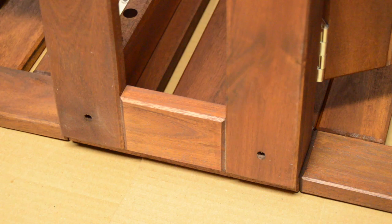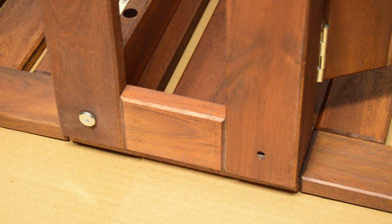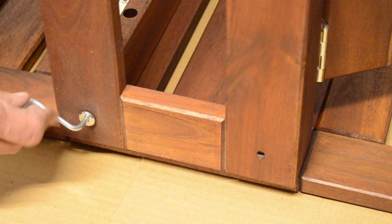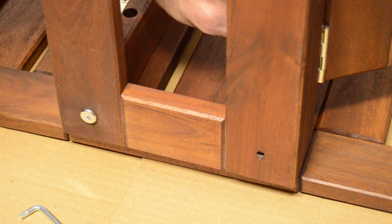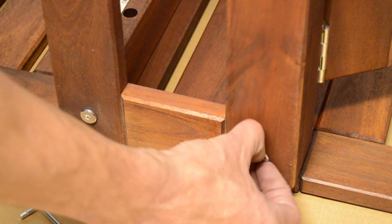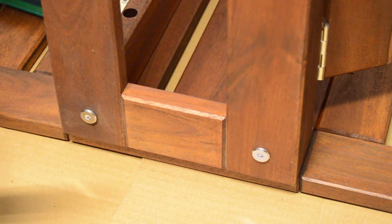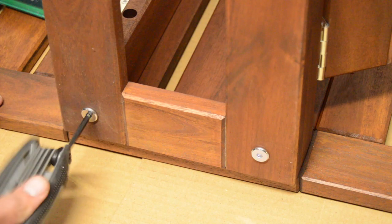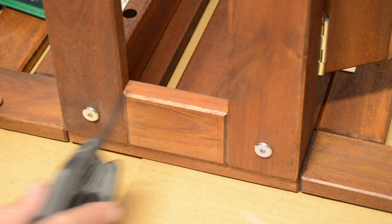There's a little Allen wrench or hex key that comes with them, and I just used my little handheld tool. This one is just resting against the dowels, but you can actually get that bolt started into the nut with it just touching. I think they kind of designed it like this — so if you had a tight fitting, you can basically use the bolt and nut as a little press to press that leg onto those two dowel pins. Got my little nut lined up, and from there you can just get it started. You don't want to go all the way in on one side — you want to alternate them a little, maybe a quarter inch or so at a time, working one side then the other until it's on there. Then just snug it down.